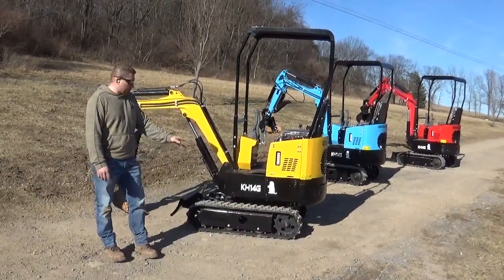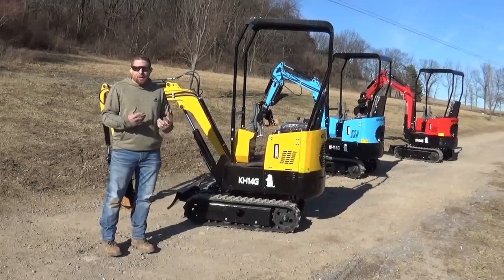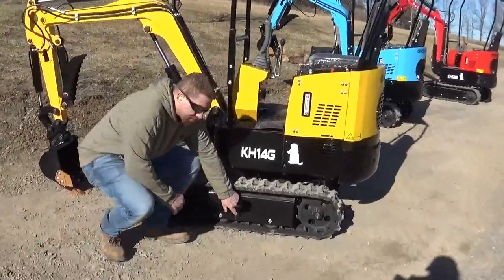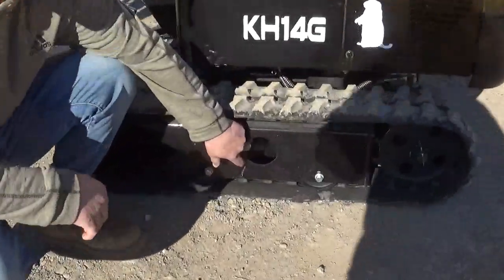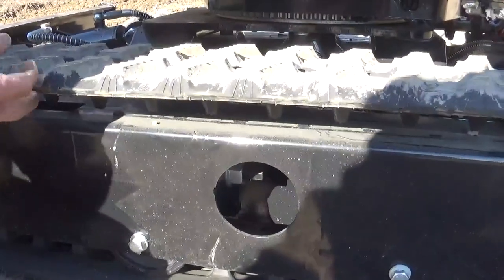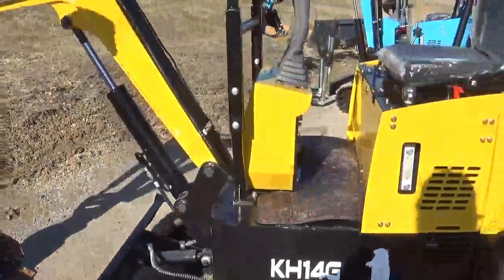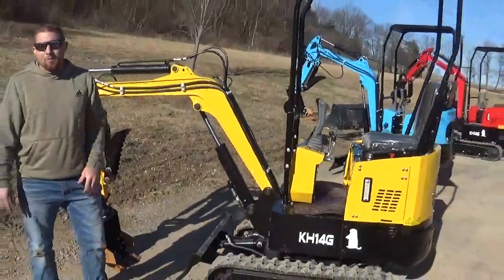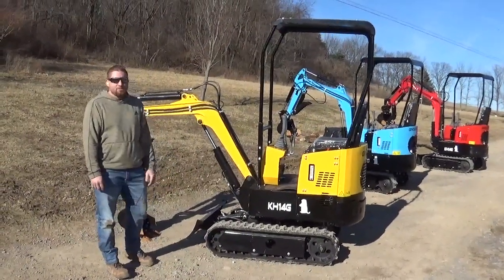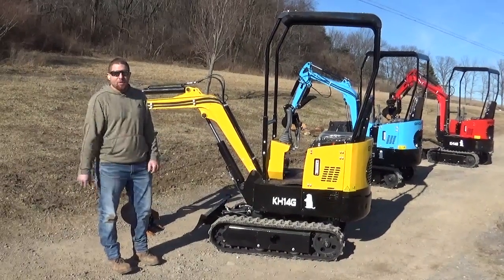Your tracks are one of the wearing parts. When you start running your machine it's going to break in the tracks — they're going to stretch a little bit. The tension is very simple: there's a nut right inside here in your undercarriage, you just tighten that nut up some and that'll get you track tension. You don't want them super tight — you want a little bit of play so when you're twisting and turning they don't snap or tear. Just a little bit of play is good; you don't need them laying on the undercarriage but you don't need them so tight you could play piano off of them.